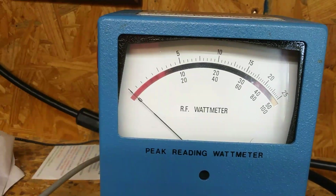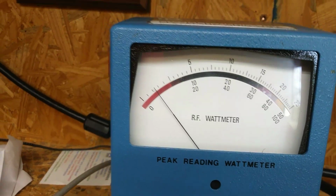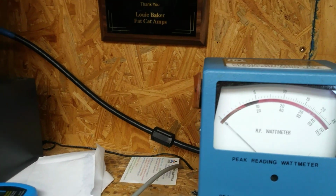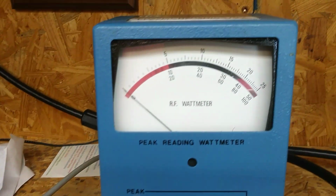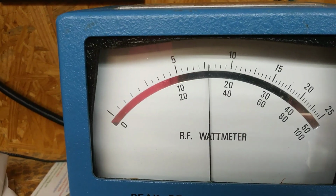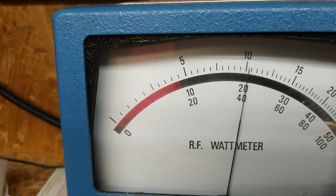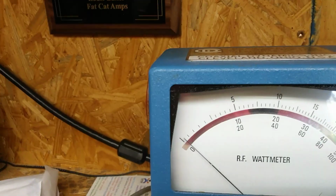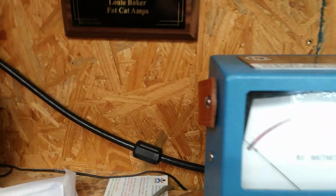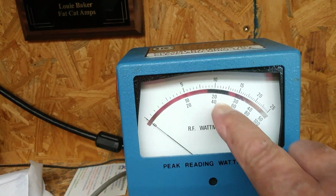So we'll just take him first, about 50 watts. Turn my mic gain up. Let's see what it's doing, RMS. Hello audio. Break. Hello audio. Okay, so doing over 400. We're all reading the bottom scale, so the 40 is 400.